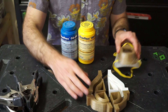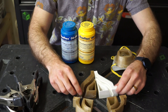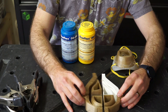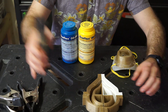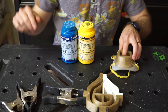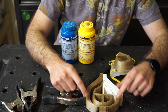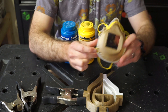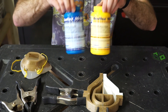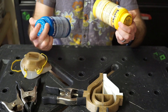Just like the base mask, the molds are also designed to be 3D printable. There's a lower left, a lower right, a top left, and a top right, and these fit together like so. You can use standard spring clamps to pinch each face together. To get the registration of your mask to fit in properly, there are small notches on the inside lips of both halves that align with the mask tie strap positions. You then take your two-part silicone — I use the 00-30 from Smooth-On.